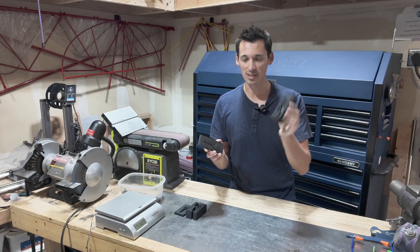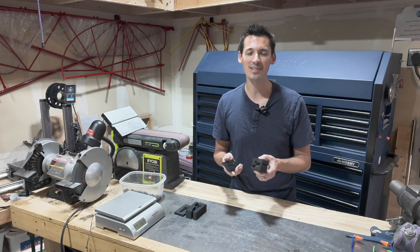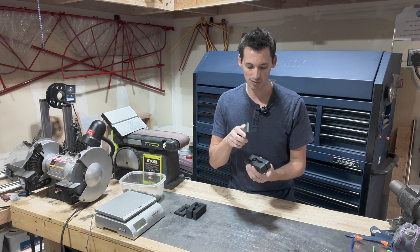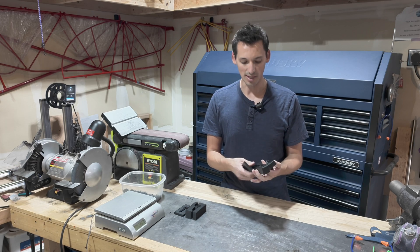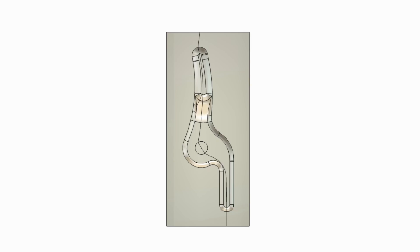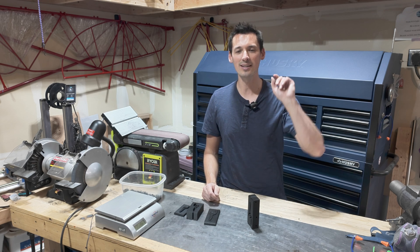This mold is a two or three-part design. You could have this as a single piece with a piston piece — you put all the forged carbon in, wet it up with epoxy, and keep stuffing it in. The ratio you want is 60% forged carbon to 40% epoxy. Once filled, you clamp it down using screw holes. I did a three-piece design because the cavity is deep with no draft angle — you couldn't pull the part out otherwise, so I split the mold in Fusion 360 by drawing a line down the middle. If you want to watch the full forged carbon process, check out the next video.